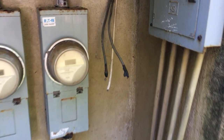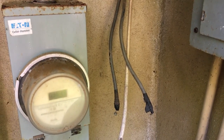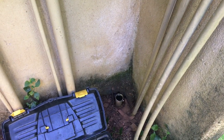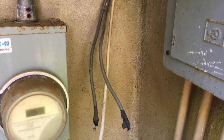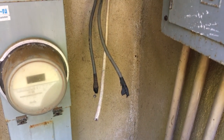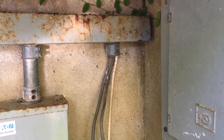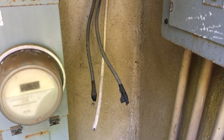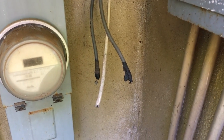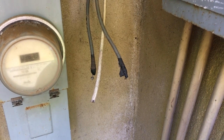Here's another fine example. This meter was never installed or has been removed. There's the conduit for the load side, and here where the meter base used to be — possibly someone thought they needed it more than it needed to be in place. You've got the two hot wires coming right off the bus bar, the gutter, and that's coming right off the transformer. If any curious person wanted to unwrap those pieces of tape, they would find themselves touching 120/240 volts.